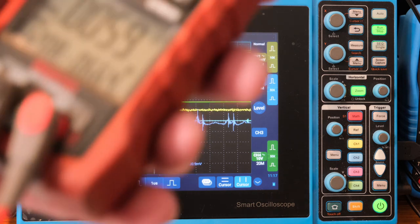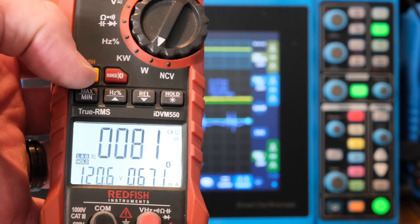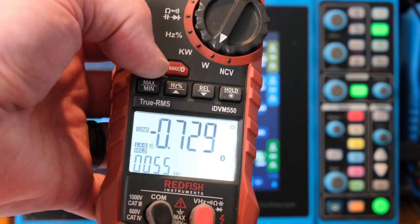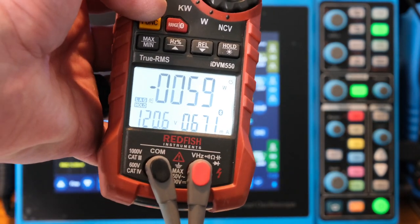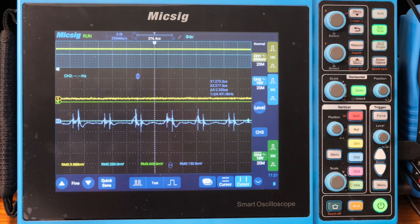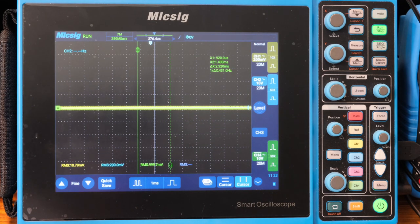Here's the blue reference signal and we're going to power it up again — the green light is on so we're running full. We're going to capture the power factor. Higher signal and higher wattage going out because of the higher voltage. Power factor capture: 81 VA, 120.6 volts, 671 milliamps. The cosine is 0.729, so we have 55 VAR of reactive power we're not really using. It's 59 watts active. There is no active power factor correction on this power supply.